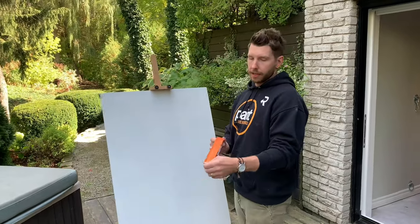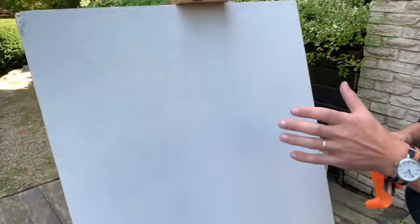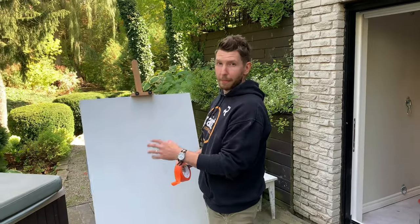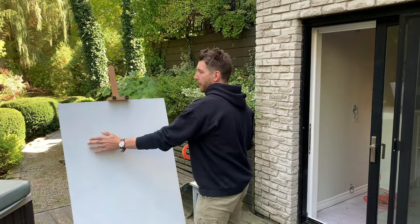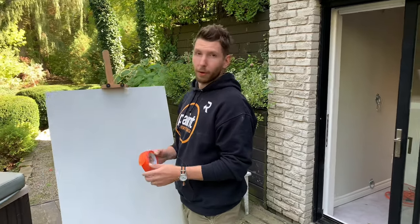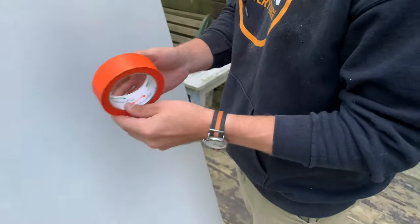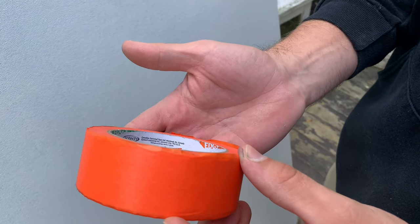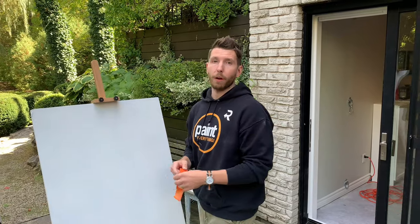There are a few things you have to think about when doing a painted tape line, and one of those is what surface you're taping on. For example, if the wall has been painted recently or has just one or two layers of paint over fresh mud that wasn't dusted properly, when you're peeling your tape the top layer of paint can come off with it. The best way to prevent that is to use a delicate tape not quite as adhesive — this is Edge Pro from Cantech, one of the best tapes for clean lines without destroying the wall behind it.